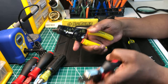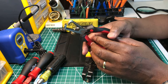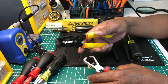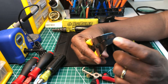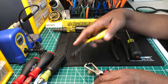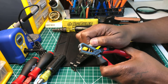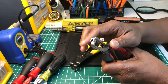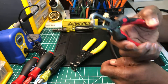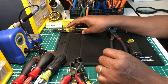This works similarly — depending on the type of wire, you may want to peel insulation from a single wire. The front opening is sized for 10-2, so it fits that wire. This is self-adjusting: you size the wire up, loosen the screw so the blades are set to the right depth, lock it in, put it in there, and peel the insulation off. These two tools work hand in hand for me.